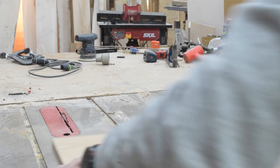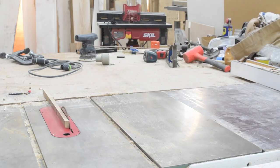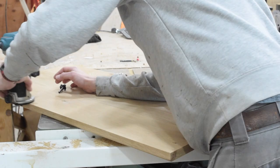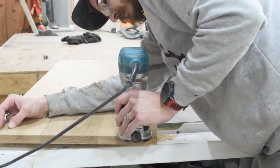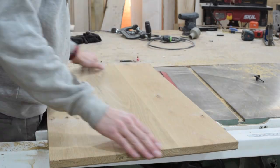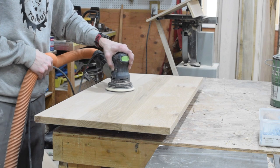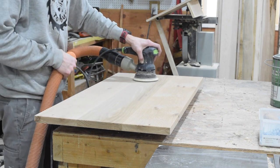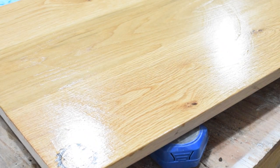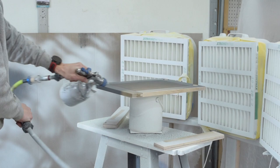That was the bench top. I run it through the drum sander, then square it up on the table saw using kind of the five-cut style method all the way around, then round over the edges, add a chamfer to the bottom just for a little more edge detail. We sand it to 120 grit, and then on the beautiful white oak I'm going to apply polyurethane. A lot of people don't like how polyurethane looks because it gives that really yellow color, but I like how that looks on white oak — it's very traditional, holds up, and matches a lot of different colors.